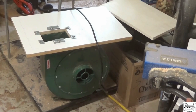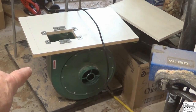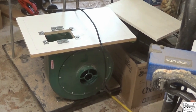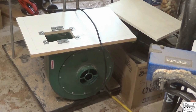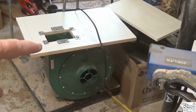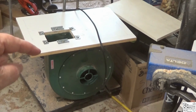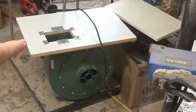I started by taking the unit apart. You can see the stand it was mounted to — I took the impeller unit off and disconnected the bags and the bag mounting mechanism. I fabricated this piece of melamine, cut a hole with my jigsaw the same size as the exhaust. I didn't have any fender washers, but I had some thin sheet metal and basically made my own. The whole idea is to increase the surface area around the carriage bolt so it doesn't bust the melamine out, and then that will mount to the wall.